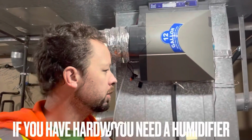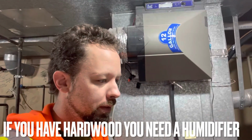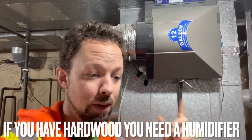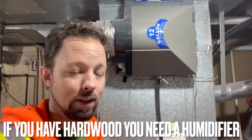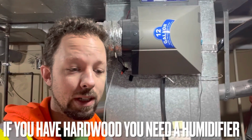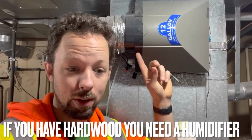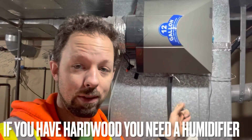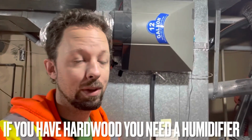So in total, you're hooking up your humidifier to your humidistat, taking the control from your humidistat to your Nest thermostat, because the Nest will track the humidity in the house and set it to your comfort level. Your humidistat could be upstairs on your wall right beside your humidifier, or it could be actually on the furnace itself. It does change, and your mileage may differ for what setup you have.